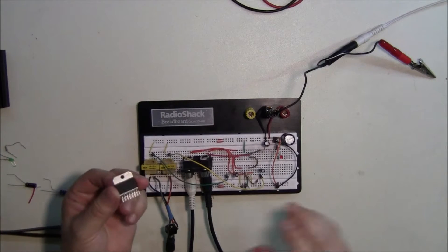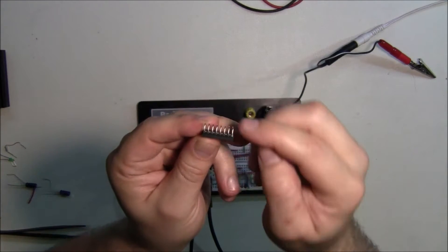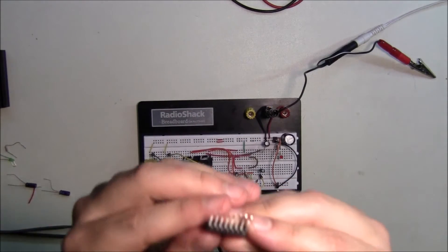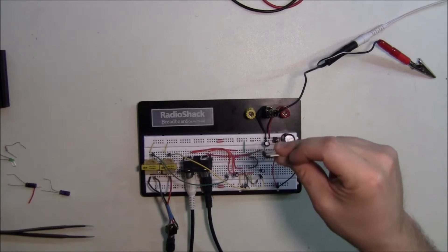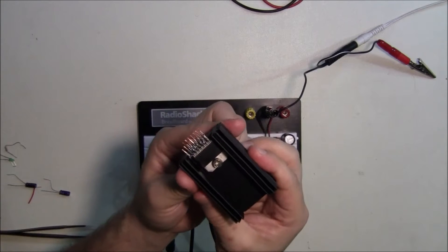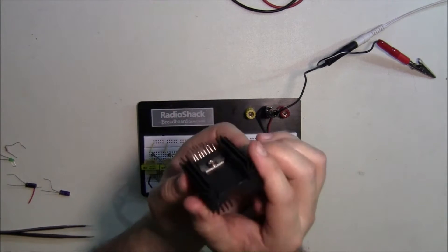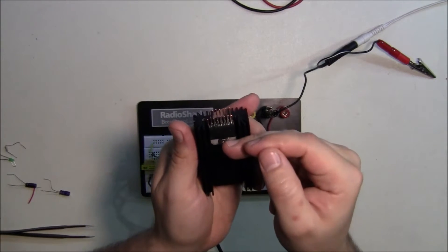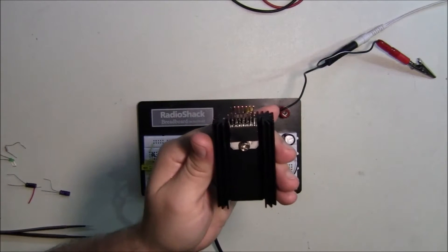Here's the breadboard, and before we go into everything on here I want to talk about this chip for just a second. This is the STA540. If you look at the pins you can see that they're staggered, but not in such a way where they're 0.1 inch apart. So I actually had to take one of these chips and slightly offset the pins — I had to bend each one a little bit so that at least one of the pins would line up, so it can plug right into the board. Right now I'm going to use this pin without a heat sink. I do have this one built up with the heat sink. These things do get hot enough — you're dissipating around 18 watts, which is a lot of heat for just that chip. I happen to have these extruded aluminum heat sinks lying around and this chip package does fit in there quite well. Unfortunately it's tall enough at the bottom where these pins wouldn't sit in the board, so I had to solder on little chunks of wire. No biggie — I can still use this when it's on a breadboard.